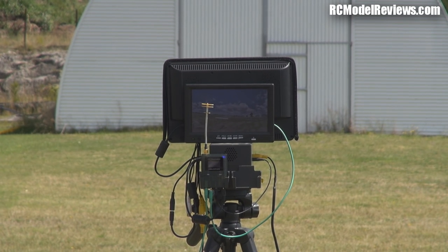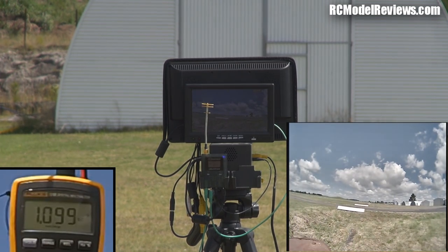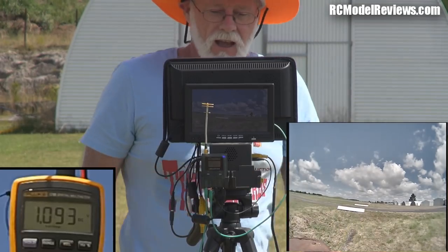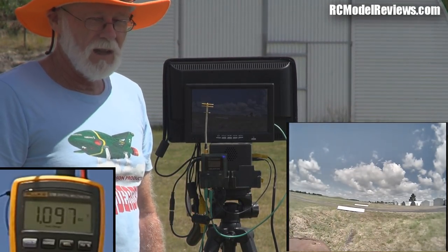Now we have the Pagoda on each end, and I'm expecting to see a higher gain from these antennas because in my experience they have really good gain, but they do have a bit of a hole in the top which is where they get their gain from. The RSSI is 1.0 or 1.1 basically, which is pretty damn good — noticeably better than the Triumph antenna was. So we do have more gain.